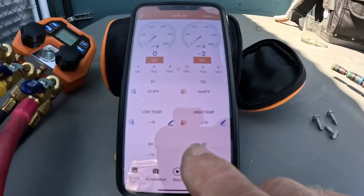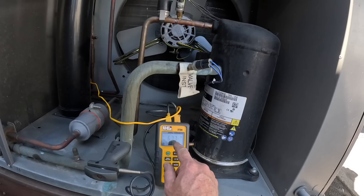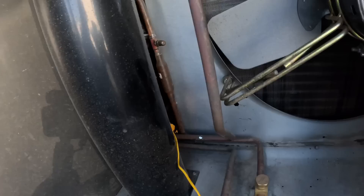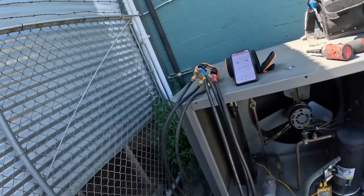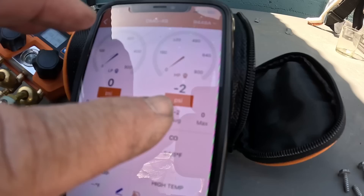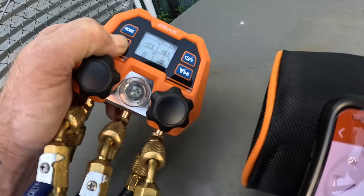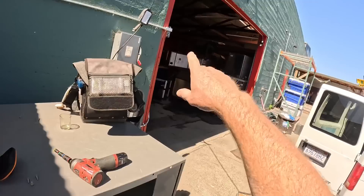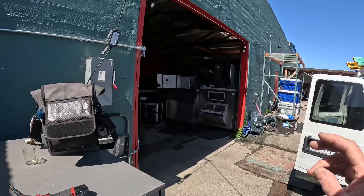On the app I'm going to fill in the blanks for my temperatures because this doesn't have temperature probe capability. RJ Parker pointed that out, but for self-contained refrigeration I think that little gauge will be fine. I've got T1 here going to the suction line so we can get our compressor superheat, and I got T2 going over for sub-cooling before the receiver. Usually on these commercial refrigeration units they don't really run a whole lot of sub-cooling — just a little heads up there. We'll go ahead and get gauged up, make sure we're zeroed out. Let's hold down the zero button — there we go, zeroed out. We're ready to get this thing hooked up and start up.